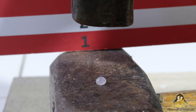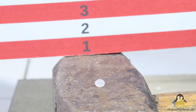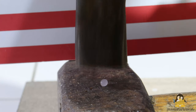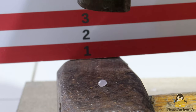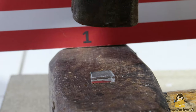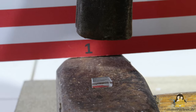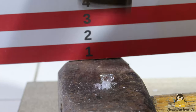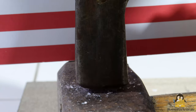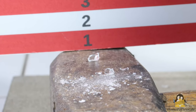The following is a PLA pellet with a diameter of around 4 to 5mm. A drop of 2cm leaves no visible marks on the pellet. Even dropping the hammer several times from a height of 3cm does not cause the material to splinter. The last material is a piece of glass with dimensions of around 10x10x2mm — less than 2cm is enough to shatter it. If the hammer is dropped several times from this height, smaller and smaller splinters are formed. I worked with glass powder a few years ago and the hammer or ball mills mentioned before work very well with this material.